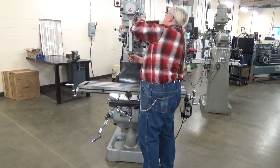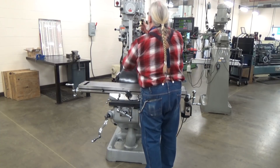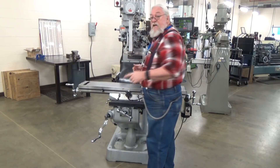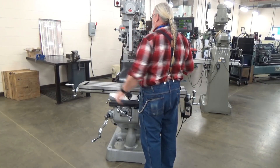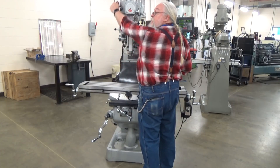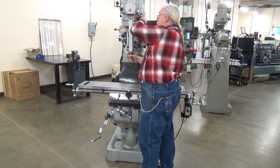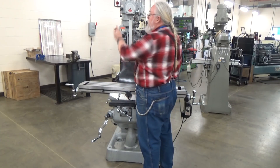Sometimes, like this particular machine, it's very difficult to get it into high speed after you've been in low gear. You find that sweet spot and it kicks in. If for some reason you put it in low gear, turn it on, change it back, and haven't got it fully engaged, it will make a horrible grinding sound. Everyone will know you were grinding the gears. If it's fully engaged, it will make a nice smooth running sound.